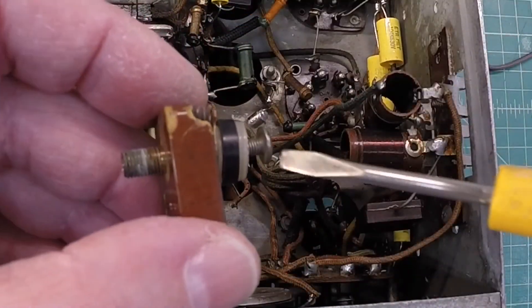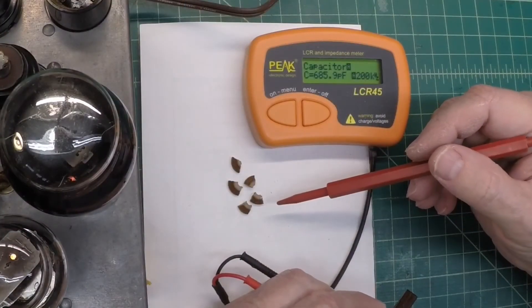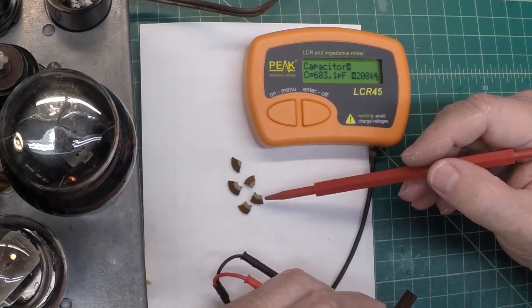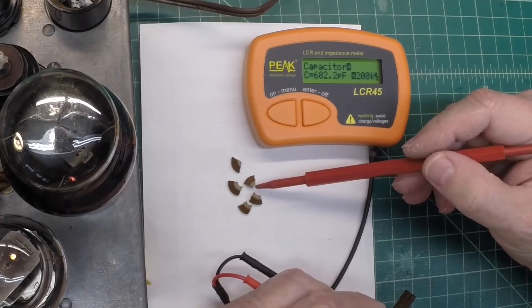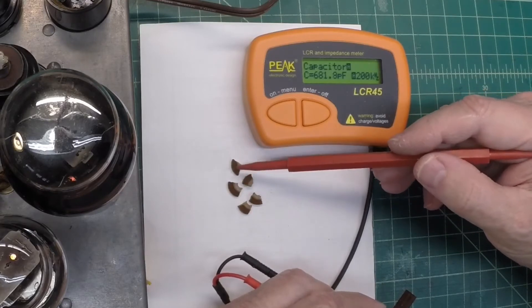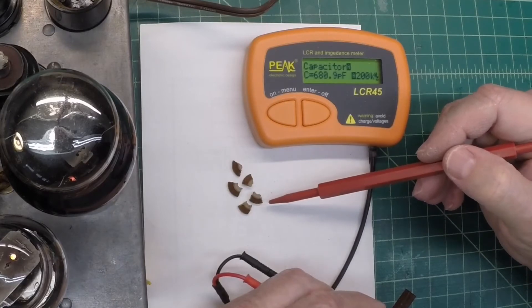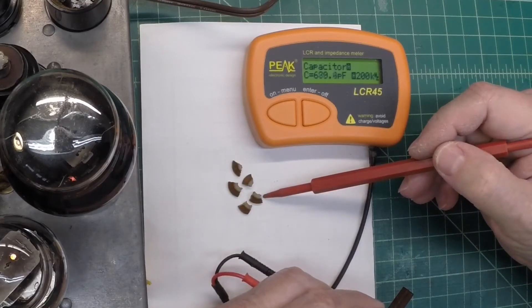I can see now I have them doubled up. I have the padder issue corrected — I used those nylon washers as well as a rubber washer. What appeared to be happening is I would tighten down the padder, but since I already had the cracks in the material, it actually released itself. So I created more spacing between the plates, thus decreasing my capacitance over time. That's why it was intermittent.